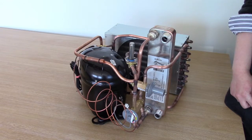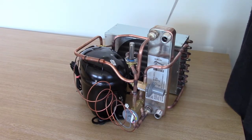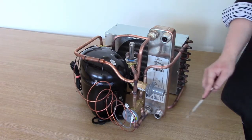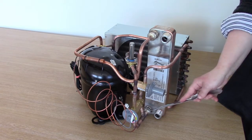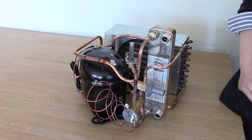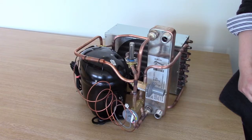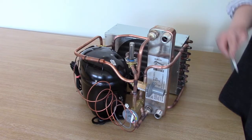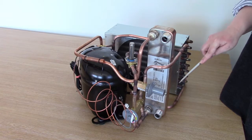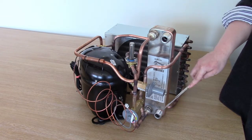The point in the system where a customer's fluid meets ATC's refrigerant system is at the heat exchanger or evaporator. We pass refrigerant through the evaporator from the bottom — it changes state and leaves via the top. At the same time, the fluid that we pump into our customer's application is passed into the top of the evaporator. It is then pumped down, removing heat energy, and leaves out of the bottom of the evaporator.